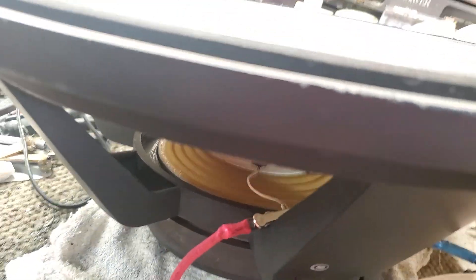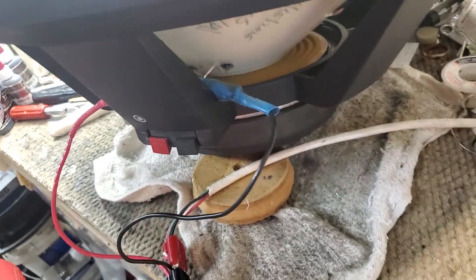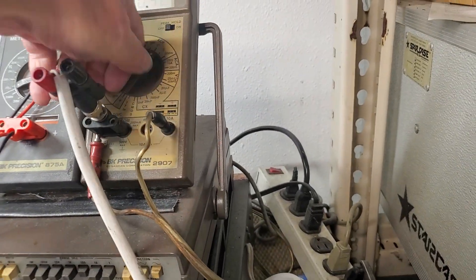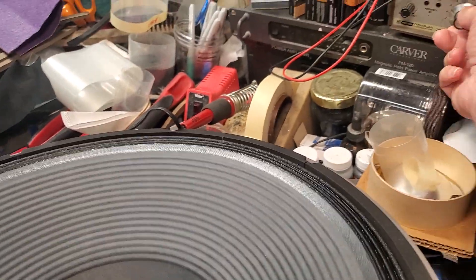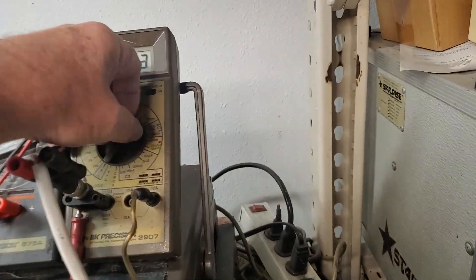Let me adjust some things here. I'm going to put it up on a tilt so the vent doesn't get blocked. What we have is almost 11 volts of test voltage on the sweep generator. For free air resonance, we're looking for the minimum current draw.